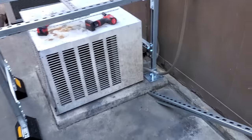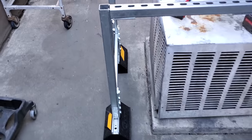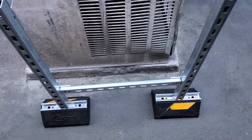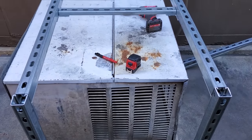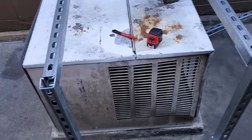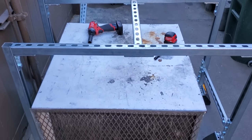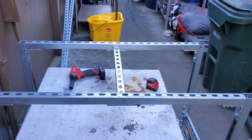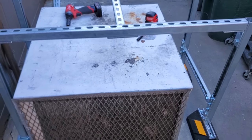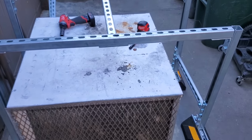Alright, I got the stand built. We got some post bases on the bottom, some support bars across it. It's nothing too fancy. I used a bunch of little stuff that I had around. There's no need for the support bar to be a deep channel. It measures out pretty good, it's pretty level. We'll field adjust it once we bring the new condensing unit out. We'll probably go ahead and bring back the new condensing unit and start installing it and then come back another day. But this should be good — this is more than sturdy enough to hold this condensing unit, the new one that's going to go on top.